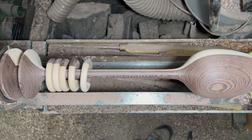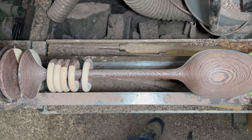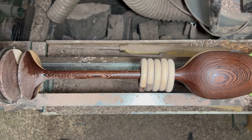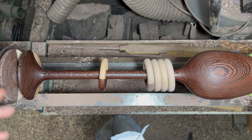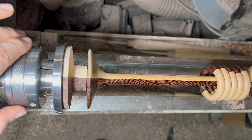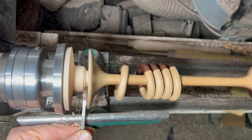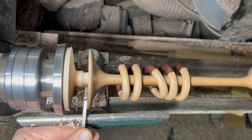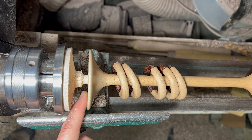Wenge — I'm going to say both pronunciations just to upset anybody — but yeah, that's looking quite nice. A bit of sander sealer. I can finish sander-sealing these, denib it, wax it up, and some nice pretty pictures at the end. Of course not forgetting the parting off — who doesn't want to see that! Everything's waxed, it's ready to go, ready to take off, finish the bottom, sand the bottom, put my maker's mark on there and photograph. I need to sand the bottom so I may as well do that quickly.